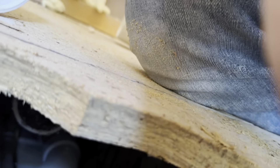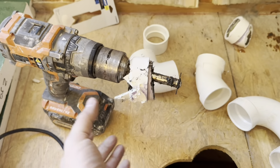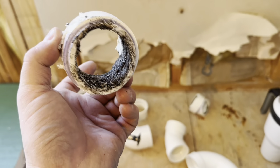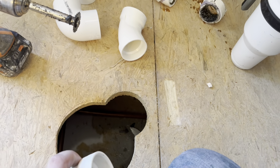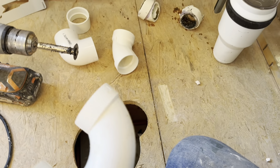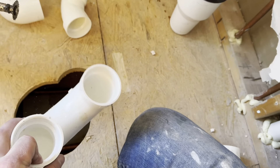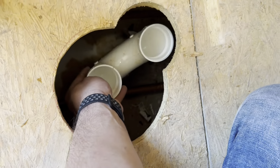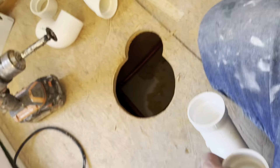This was a little more tricky than expected. Had to come in here with the inside pipe cutter and we took that old p-trap out - that is nasty. So now what we're gonna do is put a whole new p-trap in. It's much easier to get it into position. Tried the double bend but it was sitting too high off the floor, but we'll be able to slip this in right here and connect it to the old pipe with a coupling and an extension.